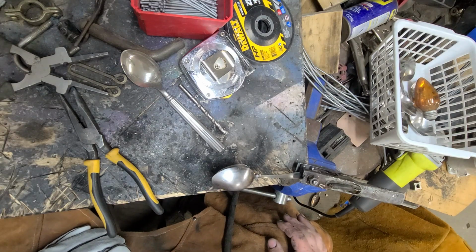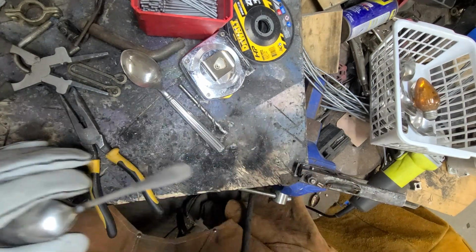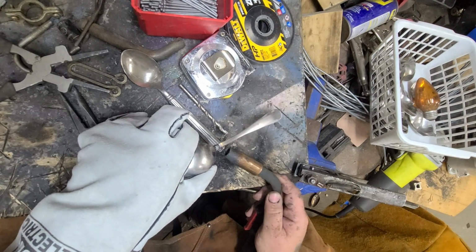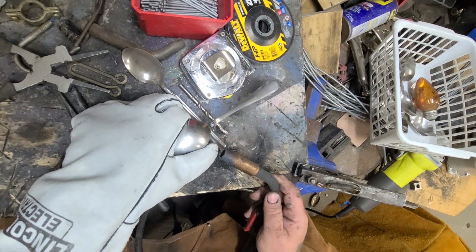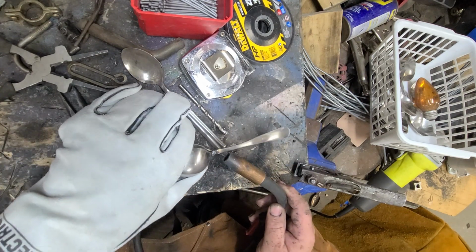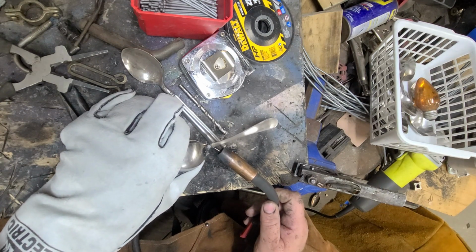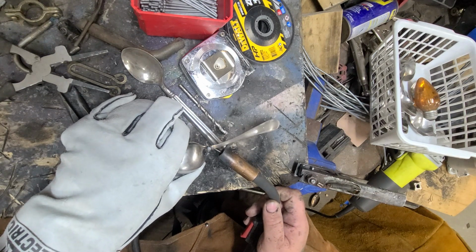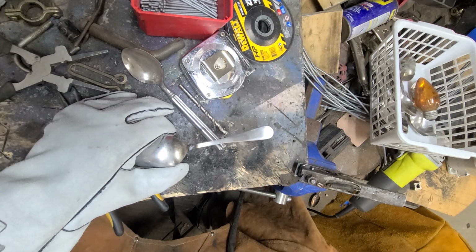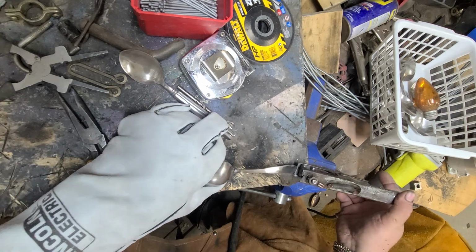Now the next thing. Does it melt the wire, the metal or something? So the electrode comes in, and when it comes in, it does a couple things. This is a filler material, but more than that, it actually melts the metal. Do you see the heat line right there? It's blue there, and then it starts going to copper color. It's actually making a molten pool, and I'm moving the pool as I do it. Yours will not be this pretty, but that's normal.